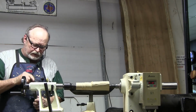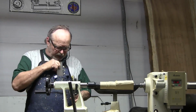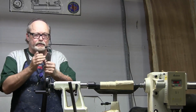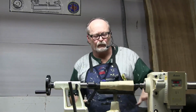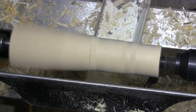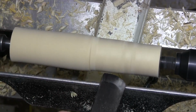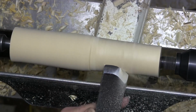And when you hone, it's almost always under 30 seconds is all it takes. If I have to hone and it takes more than a minute, I need to be at a grinder. So don't let anybody tell you it's a waste of time. You got to sit down, chant a mantra, and just do this and do this. No, it's very quick. It's like a cold swim in and out. So here's the planing cut. Sorry, don't need that kind of speed. Got a nice knot there. That's nice.